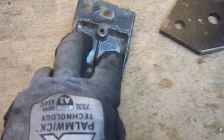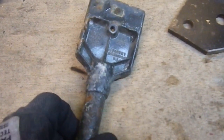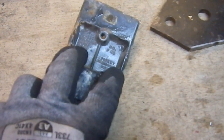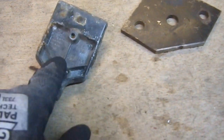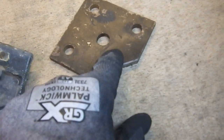And then I'm going to drill 2 holes here because I want 3 holes. I want a triangle because that's the most stable design I can come up with. So now I'm going to have to mark in where I want those 2 holes to be. They're just going to be right through this, and I think this is just aluminum, so it shouldn't be difficult to drill at all. So mark those in, drill them, and once I get them drilled, clamp the whole thing together, and then transfer those holes to this, so that I can then drill the 2 holes through this.